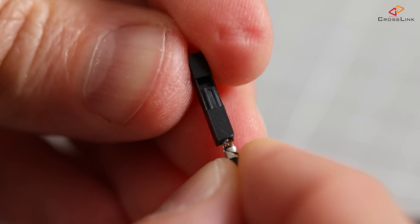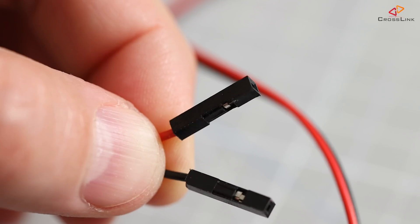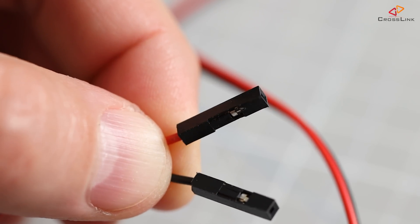I'm adding Dupont connectors to make the connection as clean and easy as possible. As a prerequisite to using a filament sensor on the Creality stock mainboard, you will have to have a place to connect it to — that would be a GPIO pin for the sensor where the trigger switch signal can be connected to the electronics of the mainboard.